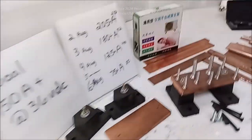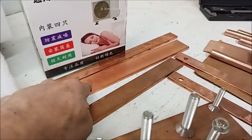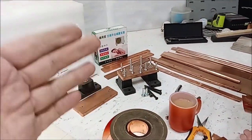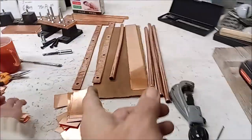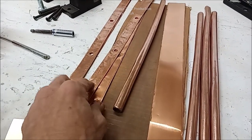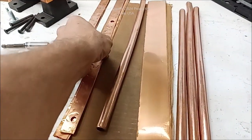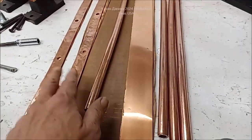I could go the individual lug route at about $35 a bar, so $70 to do both sides - or actually $140 to do all four rows connecting everything together. In a previous video you'll see where I used half-inch copper and added three layers of this metal foil, six layers when doubled, and ended up with over 500-amp capability.